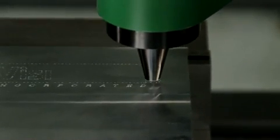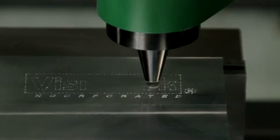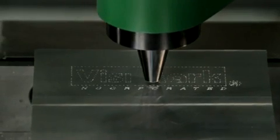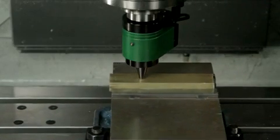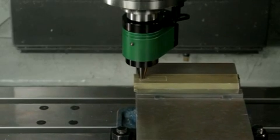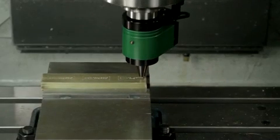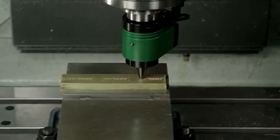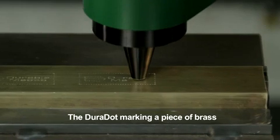The overall process is very similar to integrating a tapping head or an angle head. The Duradot head gets its power from the CNC's spindle rotation. The rotating spindle actuates a tungsten carbide stylus with a controlled radius tip, which in turn strikes the material to be marked, creating a controlled indentation. The depth of this indentation can easily be adjusted by changing the spindle's rotational speed. Lower RPMs will decrease the velocity of the marking stylus and result in less marking depth, while increasing the rotational speed will generally result in a deeper mark. There are no hard limits on the feed rates you can program, but at some point the machine cannot react fast enough to achieve an improvement in cycle time for the short distances moved when drawing small characters.